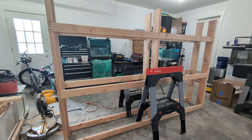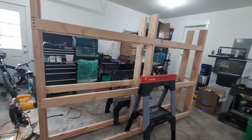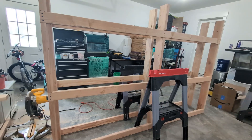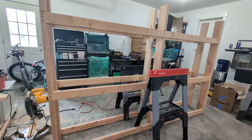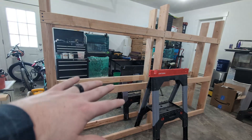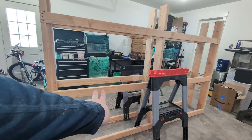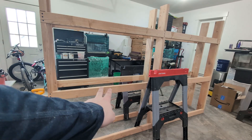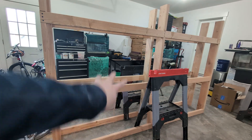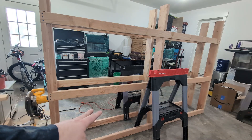This is what it's going to look like — very thin because these are only 20 gallon tanks and they're only a foot wide, so it'll be about 13 inches wide. The two sides can't stand on their own, so we need to attach the supports. We're going to put one support at each end, two in the middle — overkill, but why not for fish tanks? Those four supports will go in all aspects of this stand. Let's start attaching them.